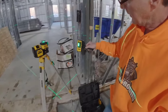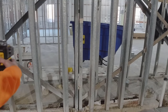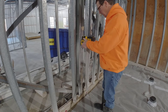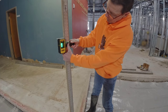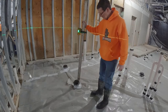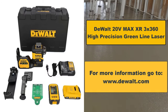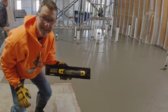If you need something with a receiver on it like we do — we use a grade stick for checking levels of different things — this is going to work really well for you. You don't just need to put it on a tripod; if you have some type of metal you can mount it on, this is very lightweight and the magnet was really strong. That's how we left it on this job. We had to match this area of the floor throughout the new concrete pour, and having the receiver on the grade stick was very easy for checking different things. I'd highly recommend this — it was my first job using it. For more information you can go to DeWalt.com, and DeWalt also makes a really cool mag float. Thanks for watching, come on back and we'll see you on the next one.